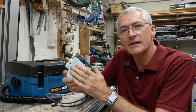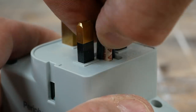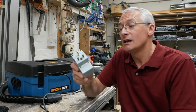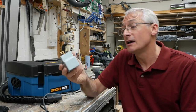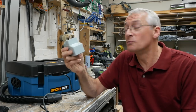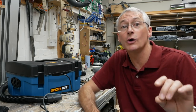Now you might be thinking — this little thing is designed to supply power to TV boxes and gaming consoles. What are you doing running a 1,250 watt extractor through it? Well, this Intelli Plug comes fitted with a 13 amp fuse, which means you can run a little over 3,000 watts through it at the UK's 240 volt mains electricity. I've run this extractor and that sander through this little power adapter for well over half an hour and all that happened was it ran a little bit warm. I was actually more concerned about the heat generated by the extractor than by the Intelli Plug. But if you have any concerns or qualms at all, just don't do it. I'm providing this as a way of quickly and easily powering up extractors like this, but if you've got any concerns about the safety or longevity, simply don't do it. Save your money and buy something with power take-off and auto start built in.